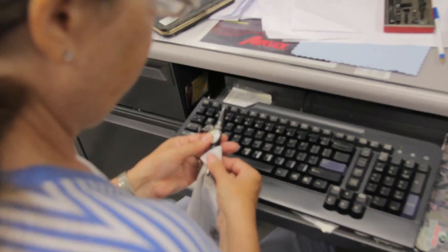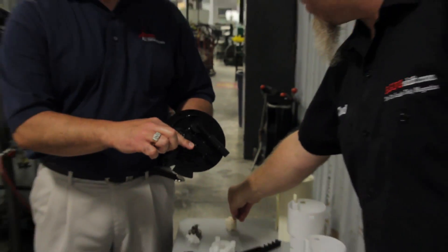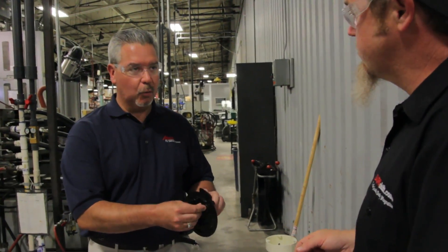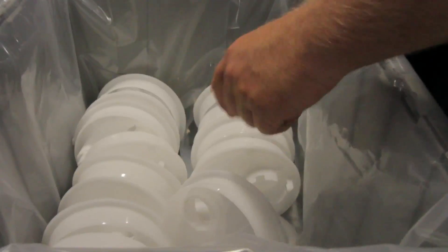The key thing is to keep them clean and calibrated. Every day the computer tells us which ones need to be calibrated that day. Critical dimensions are like the tubes that come out, because the fitting that fits onto this has an O-ring and it's very precise — this is outside the fuel tank and could go to the outside, so this dimension is critical.